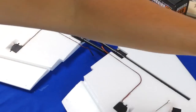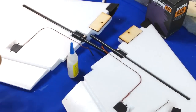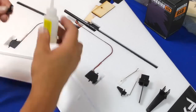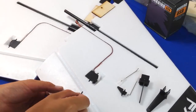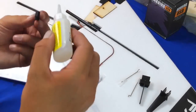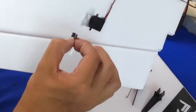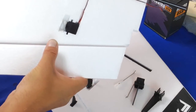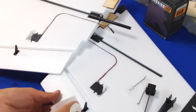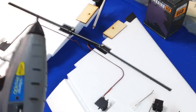I'm grabbing the control arms with the clevises on the end, and also the control horns that go into the ailerons. I'm using foam-safe CA on the control horn and also kicker — placing them in, holding for a few seconds, pretty good fit. Because this is an FPV plane going possibly long distance, I'm probably going to take a sheet of fiberglass and glass over the top just so we don't have any control horn failures. I prefer the ones that go all the way through with screws to be extra safe — you never want a failure in the middle of a flight.